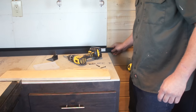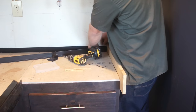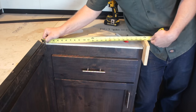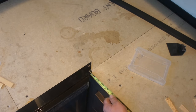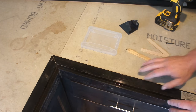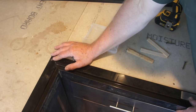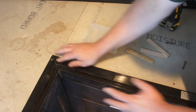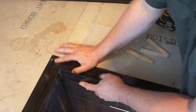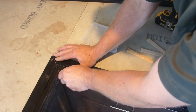I've grabbed an extra piece of my backing here and I'm just going to use this as a height reference. Same routine here — we're going to pull a measurement right off of this front edge of the second form. Quick pro tip: if you're a beginner and you're not 100% confident in your cutting and measuring, cut your pieces a little bit large. Bring them over and test fit them — you can always cut a little bit off. But you hate to throw away an entirely usable piece because it's just a little bit too short. In this exact instance, I'm about a blade width too long. I can easily trim off that blade width — I'd rather be over by a blade width than under by a blade width.